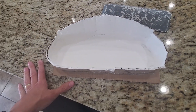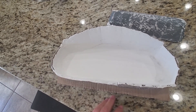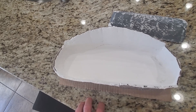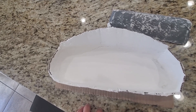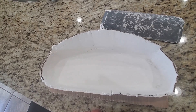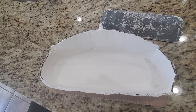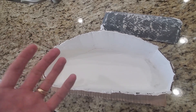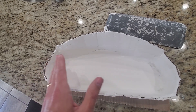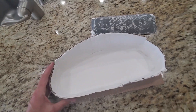For this fiberglass part, normally I'd make this really nice and smooth so I can take a clean mold from it. But this one I'm actually going to do the opposite — I'm probably not going to get it super nice. I'm going to take the mold because trying to sand all these inside surfaces is challenging, and when I get the mold it'll all be on the outside, so it'll be much easier to make smooth and nice. So I'll get this just to the place of no cracks and fairly smooth, and then make the mold.